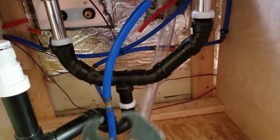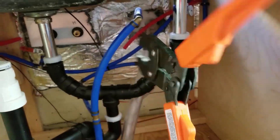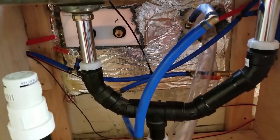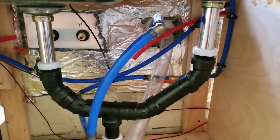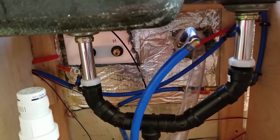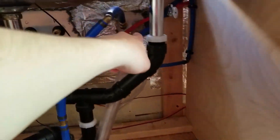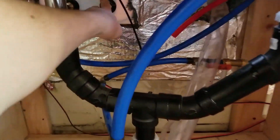It's very tight in here and this is a very big tool, and maneuvering all these angles to attach the PEX is difficult. So what I'm doing is prefabricating all of the pieces and trying to get them about in the shape that I want them. Then it's just a matter of lifting the whole thing, threading it through exactly where you want it, and then attach here, attach there, and you're done — also wherever there's a hookup like here.